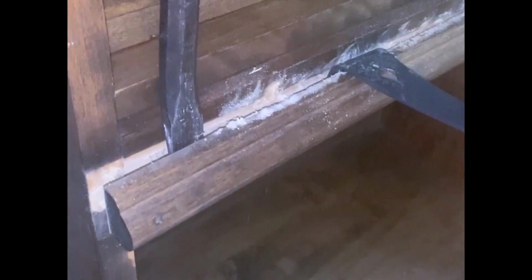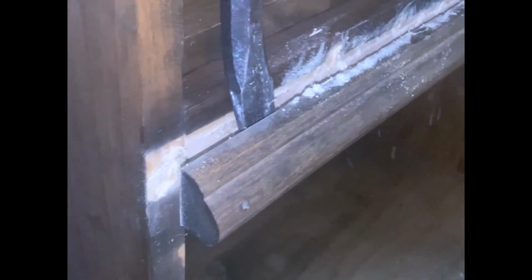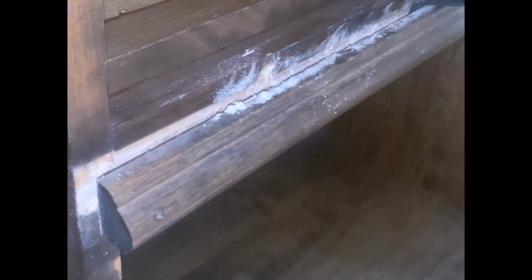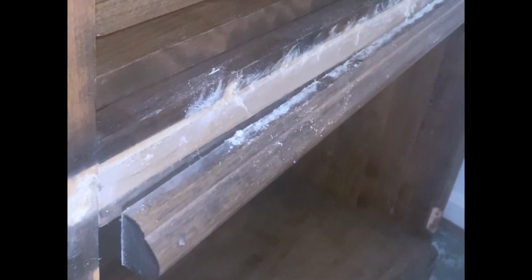If the shelves that you got also have cabinet doors on the front, they should come off really easily with a Phillips head screwdriver or a drill. And if your shelving units have any added ornamentation on them that you don't want there, like some extra molding, you can usually get it off with a crowbar. We had to use an oscillating saw for ours because it wasn't coming off very easily, but usually the crowbar will do the trick. Once you get these extra pieces off, you're going to want to fill any holes that are there from the cabinet doors and also sand down any surfaces that are probably rough after you cut stuff off of them.